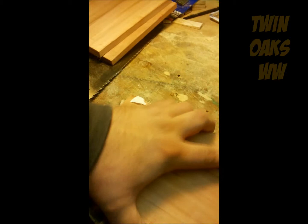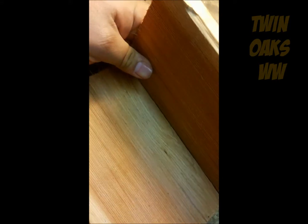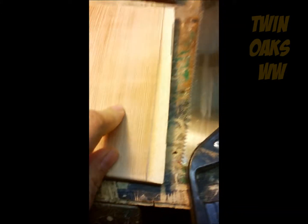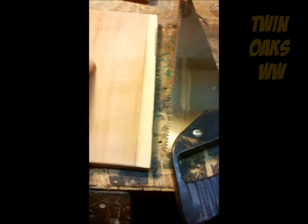These are going to be your sides or your roof. The way you want to do this is you want to take one of these, put it up on the side, and measure the thickness. Then you're going to draw a line all the way down and cut that off. Put it up to there, I've got my width — draw a line, now I'm going to cut this off and save this. Got that cut off clean, centered up — almost perfect anyway.